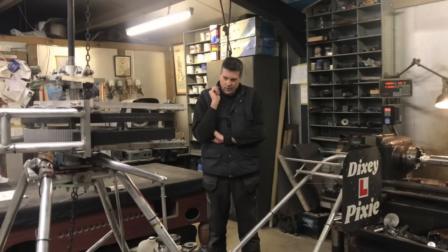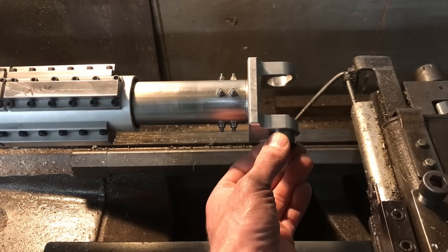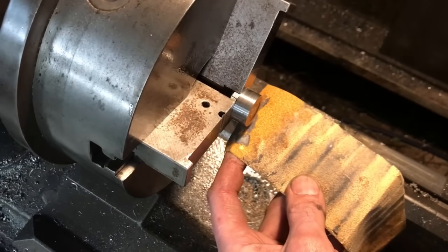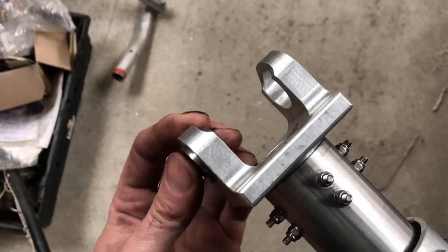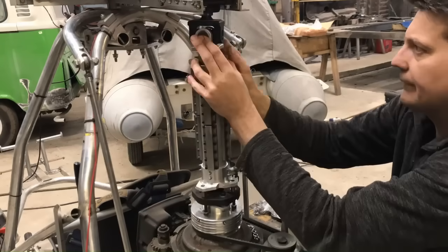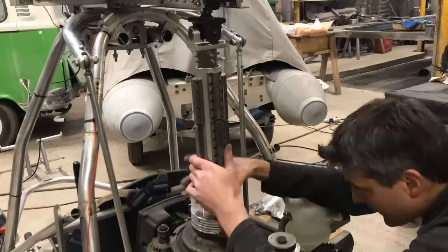I know what I'm going to do — I'm going to go home. Going home really works sometimes because you come back with the right decision. What I've done is sanded 50 microns off the bearing diameter and now it's a sliding fit into the universal joint yoke. If it has to come apart it's easy, and when I finally decide to put it together for the foreseeable future I will press in new bearings.